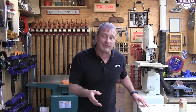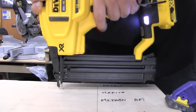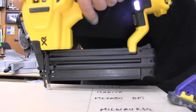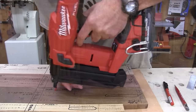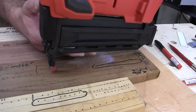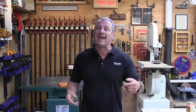That's a bit of a pain when fine-tuning brad placement and moving the nailer around to find the sweet spot. One interesting thing noticed on the DeWalt: in contact bump mode, if you depress the contact tip and keep it depressed, you can slide the brad nailer along the material and just fire the trigger at will — really nice for fast work. All brad nailers can fire in bump mode or sequential firing mode, and the team determined Milwaukee and DeWalt were the fastest nailers of the four.